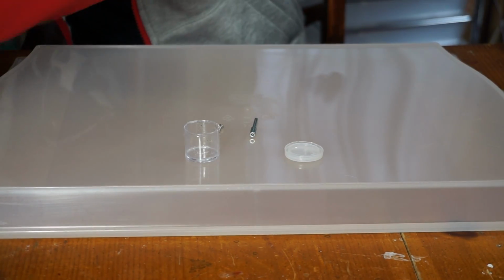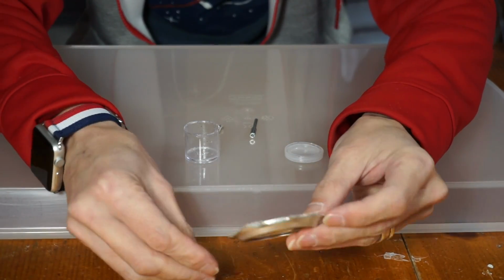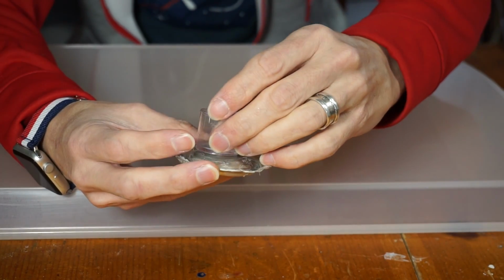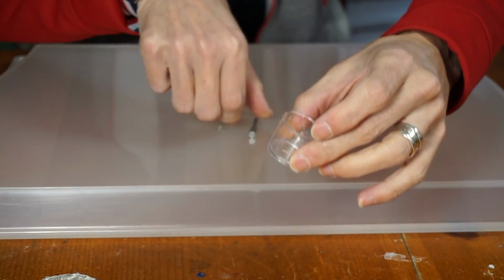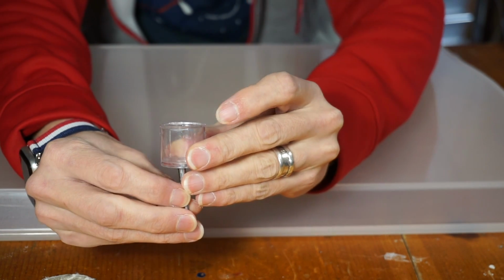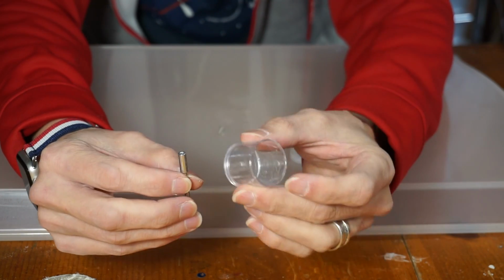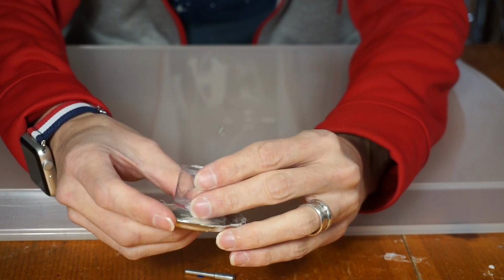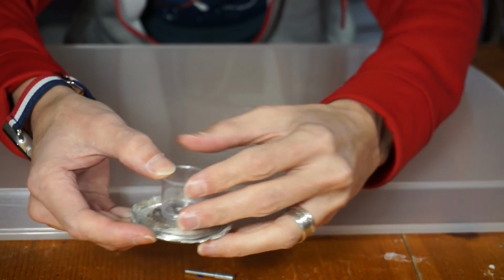Additionally, I took a tin can and cut the bottom off, okay? This is just to add stability to the little container. Because when it's just on the mandrel like this, it's too wobbly and gets off balance real quick, especially with the liquid in it, and it might fly off, especially at high RPMs, and I don't want you to hurt yourself. So this works as a stabilizing base for the container.